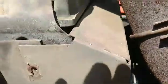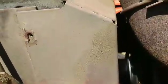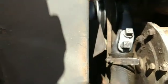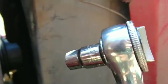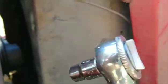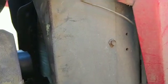And then we'll go into tighten this shroud back on. Didn't really need to take it off to begin with, or I'd loosen it, so I'm going to tighten the shroud back on. Okay, so tighten up your shroud bolts with a 3/8 ratchet, 3/8 socket, and there's 8 of them, 4 on each side. Make sure you tighten those down.